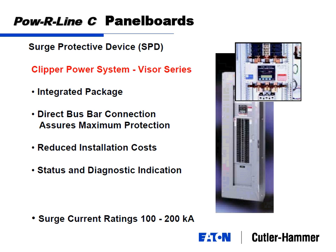When we get to switchboards, the bigger devices, because they're a little tougher to shut down, we'll put a three-pole breaker, say here. I'm not going to touch the screen. Say we'll put a three-pole breaker here and wire up to this SPD device and keep the length as minimum as possible. Maybe there's 6-8 inches that we use to feed that. And then that's strictly a disconnect means, a way to turn it on and off to isolate it if you need to pull it out of the panel. That answer your question? Anything else on SPDs?